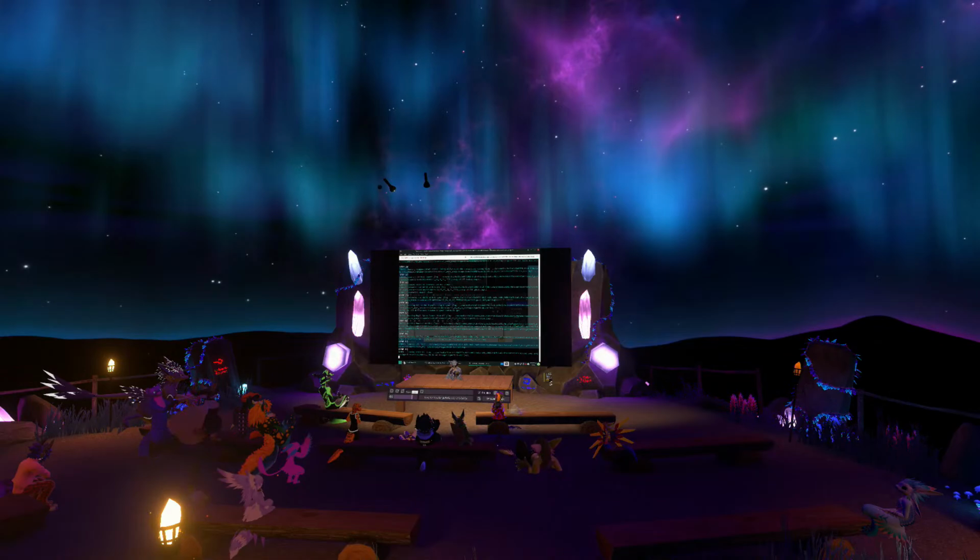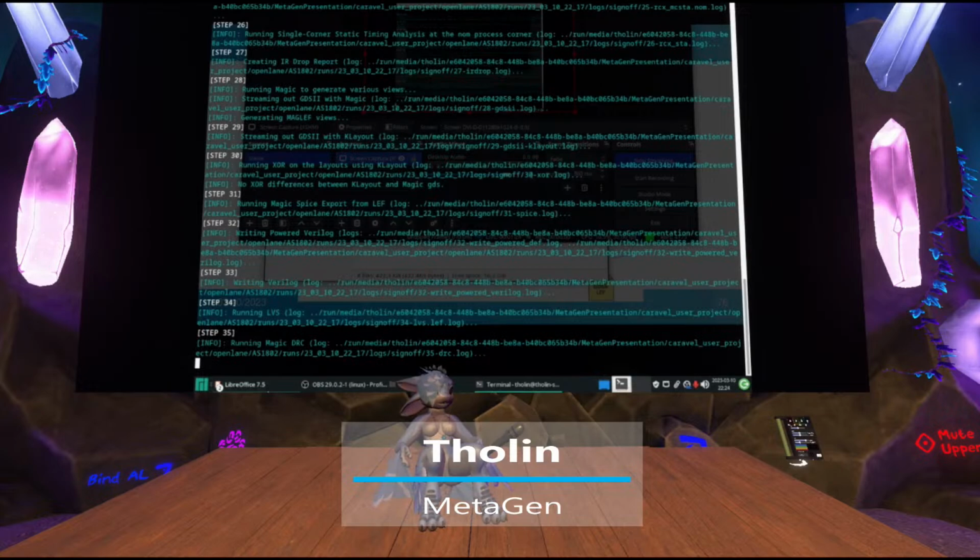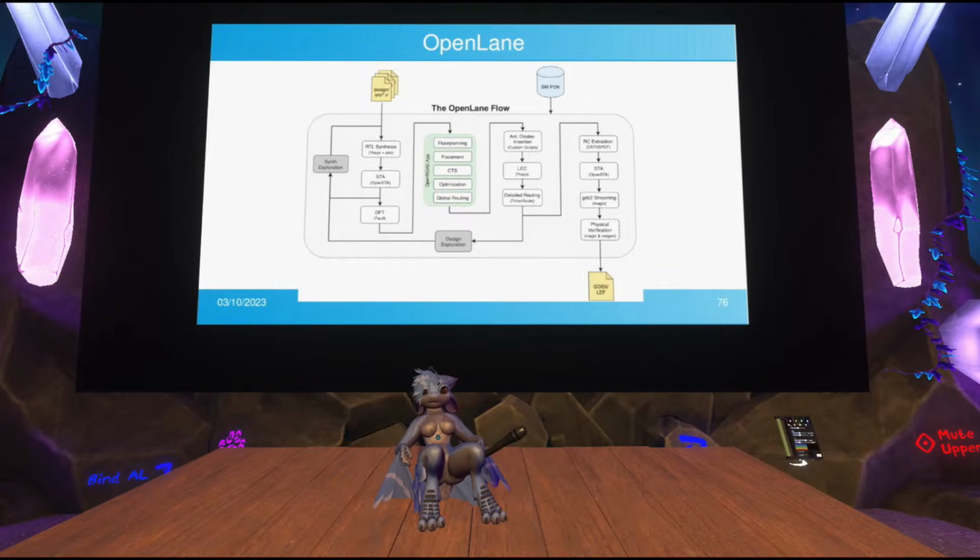So, okay, there we go, I'm back. While this is running, let me just tell you about how this is actually submitted, because right now what we're building is not actually a complete chip design, it's a macro. As I said, you can define custom logic blocks, macros, which work the exact same as you might imagine macros to work, maybe in C, for instance, where we can just copy-paste them in. The reason for this is that you really want to make every design in its own macro at the topmost level.